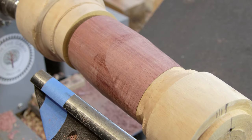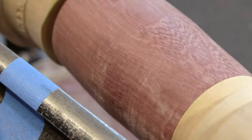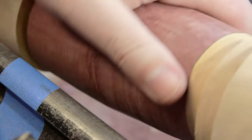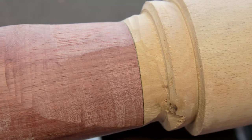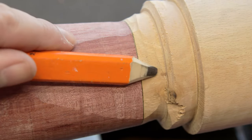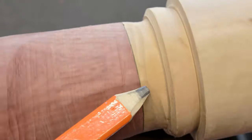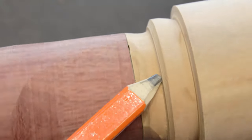So now I'm going to switch it to the next set of offset marks, which is number two to number one. When you're doing this, it's a really good idea to choose really soft wood for your ends — you're never going to get a good finish probably on this, cutting so much air, so there's going to be a bit of manual sanding anyway. The roughing gouge is nice and sharp and gives me a bit more control. Working out how far you've come is not actually that bad — you can see how far I'm coming up the waste block. I'm not quite enough yet, but if I come all the way up to this edge, I should have a good chance of getting it to be the same on that side too.